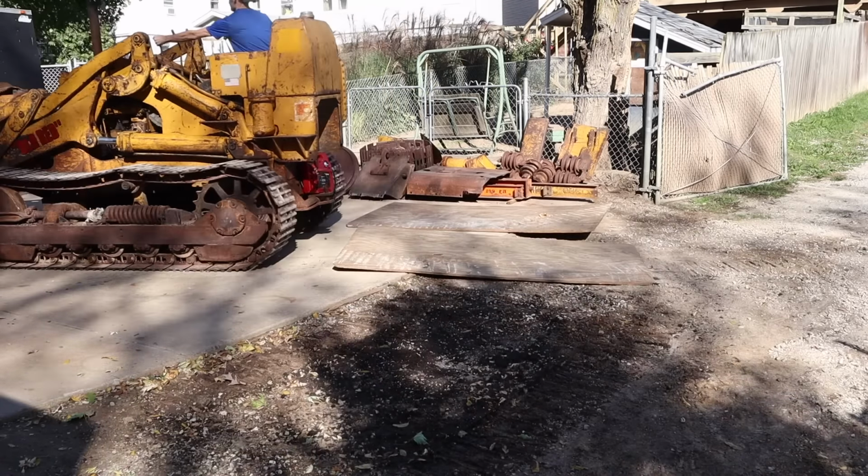One thing, this is the valve cover. And I probably need a new gasket for it because it looks like it's almost gone. Like even over here, it looks like it's not even really there. But there was some water in here. I can't even, right there. You see that? See that liquid moving fast? That's water. So there was a pretty good little puddle of water. I mean, maybe double or triple that size that spilled out.